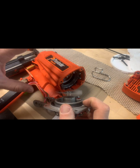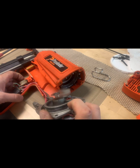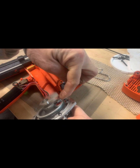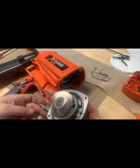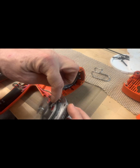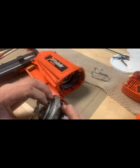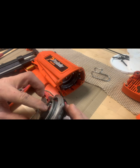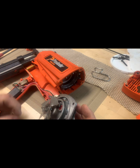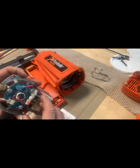That means it's making air-fuel mixture right away. And this one here is supposed to be firing it. So see, it's not firing. That little deal right there where that red is, that's where it has a little point that the hose connects to, and it's supposed to arc on. See, it has a timer in it. It shuts itself down after so many seconds, but that's where it's supposed to arc right there. You can see that where my finger is, and that fires it off in there. So unfortunately that doesn't seem to be working.